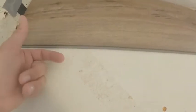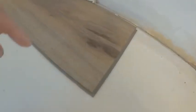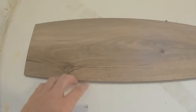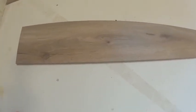So you'll see that one that sticks out farther, that's what you want to be putting more boards into, if that makes sense. And then same goes for the outer end here. You can see this lip that goes around there, versus this corner that doesn't have anything. It's on underneath, you can see, is where that ridge is. So just make sure you start with that. Wherever these little lips are on the bottom, that's where you're gonna be going to. And the lip is on that end, so I'm gonna be going that way. That's how you wanna start it. Otherwise you're gonna be fighting it, and you don't wanna do that. I know from experience. So here we go.